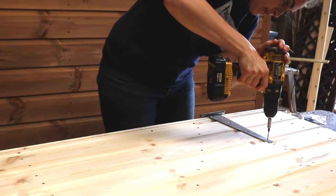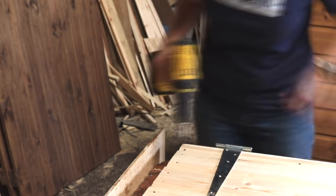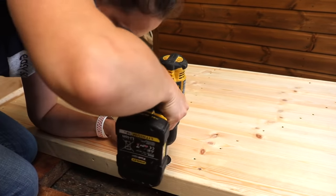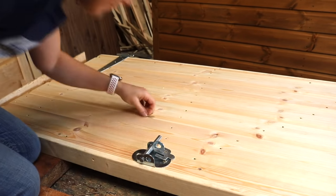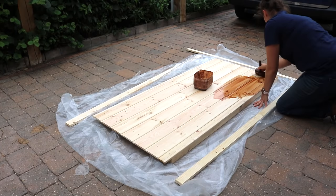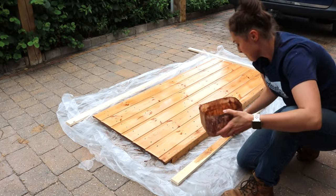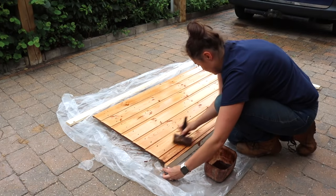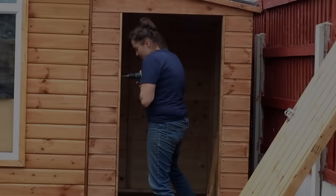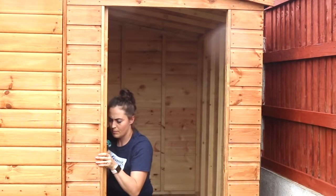Then it was time to fit the hinges, in line with the cross supports, before moving on to a bolt. I later removed this though, because I wanted to stain the whole thing twice when I got it home. I've also got two shed trims here to treat, as well as a top piece that'll be screwed to the cladding above the door. Now it was time for the treated door opening's trim to go on, and another piece just behind that called a stop lath, which stops the door from being pushed inwards and putting pressure on the door's overhung cladding.